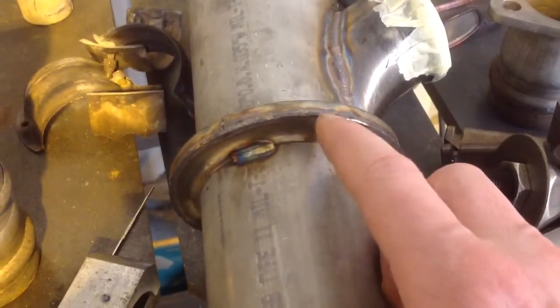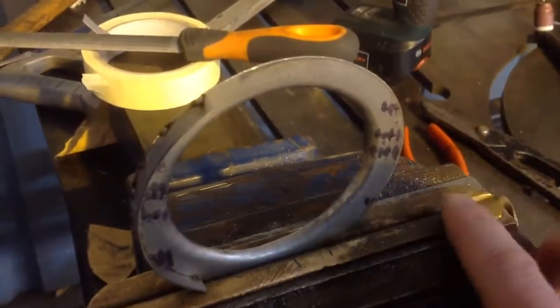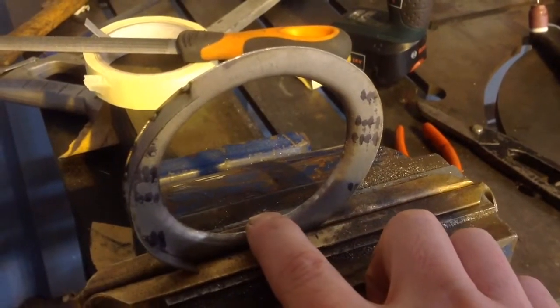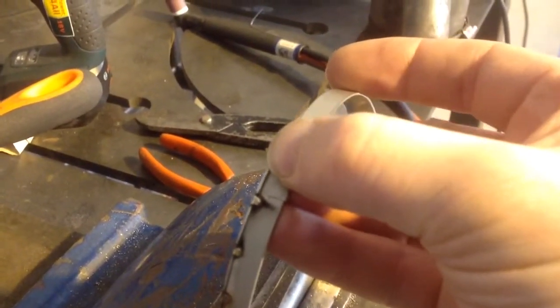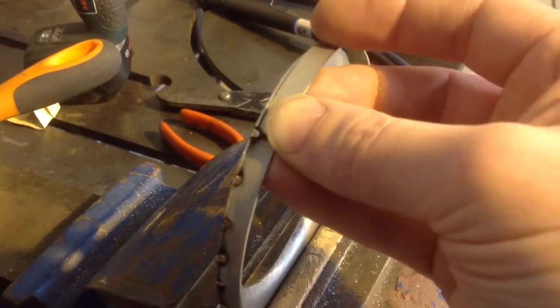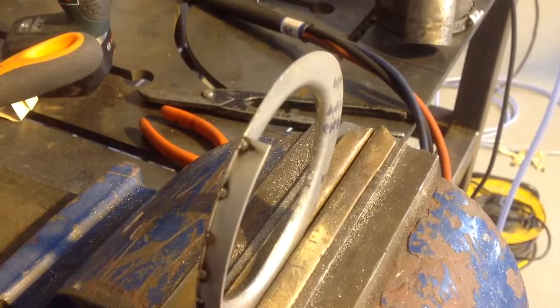So just very briefly how we made this flangey part here. Cut out with the plasma cutter, a little circle using some guides fairly accurately, a little bit of filing and then just tap the centre here into a little former that I turned on the lathe which makes it a tight fit over the tube. And for the sort of external flange, I'm just speed tacking some bits on like that and leaving myself just a smidgen of metal, maybe a 32nd of metal here at the edge to make a fusion weld all the way around. It's really quite easy.